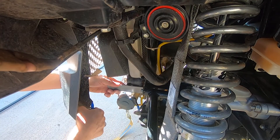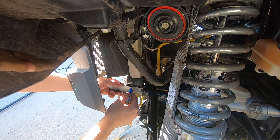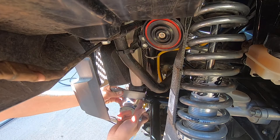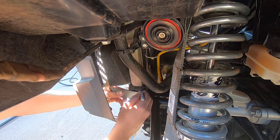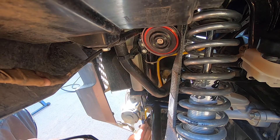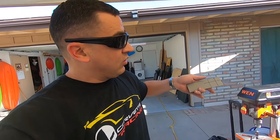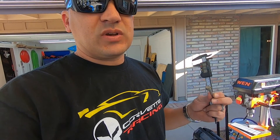The first thing I'm going to do is take my piece of metal, go in here, push it all the way back, make sure it's flush, and just mark my hole centers. Now that I have my hole centers marked and it's flush on the side where my finger is to the bottom, I can measure from this line down. I'm going to measure from that line to the center of the hole and it is 0.7 of an inch. Now that I've got my hole centers at 0.7 inch down, I'll take my calipers, measure the diameter of the bolts and go just a little bit over so I have a little bit of play. Then we're going to use the drill press and drill it out.